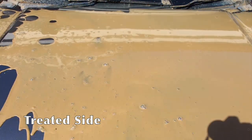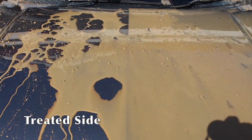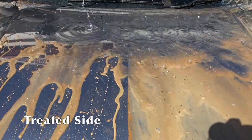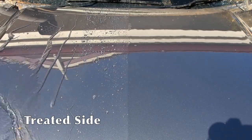One layer of coating is enough to achieve full durability. A second coat can be applied after all of your first application is completed, and given 1 hour between coats. It's important not to apply more than 2 coats.